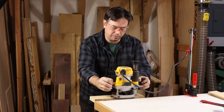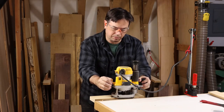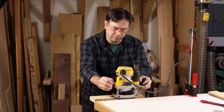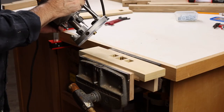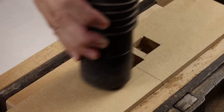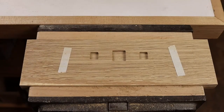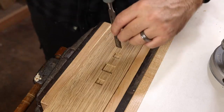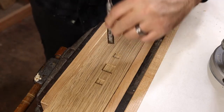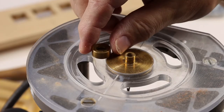This is a trio pattern — just three small squares — but I've found that this technique is really clean. You might be tempted to use a hollow chisel mortiser to do the recesses, and I have tried that in the past, but this technique with a router is just extra clean. The only thing is you will have to either round your inlay or, what I always do, is square up the recess. I just find it a little more consistent to take it to a sharp corner.